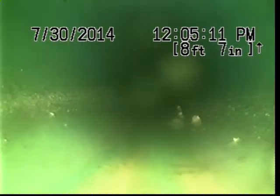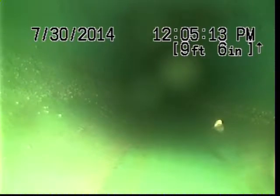I just went through the spot with standing water there. Kind of go back through it here again. Check it out. The water level goes all the way above the camera lens, so it looks like about an inch of standing water, and there is quite a lot of debris sitting in the line. There's no blockages or anything like that that would cause the water to dam up like that. It looks like the line has lost its grade there.